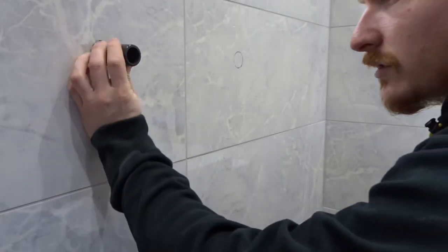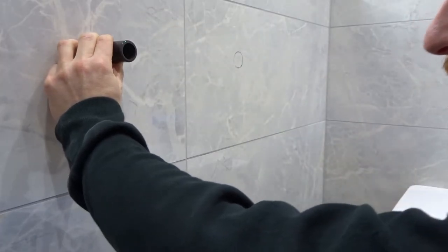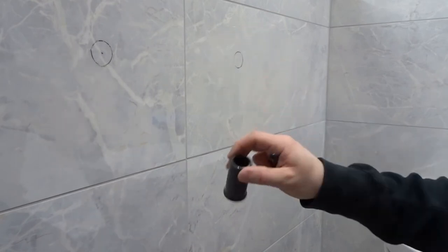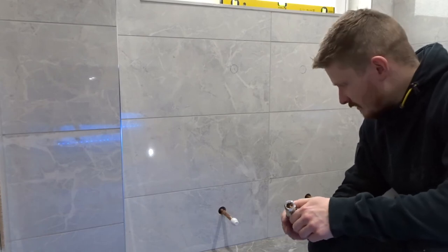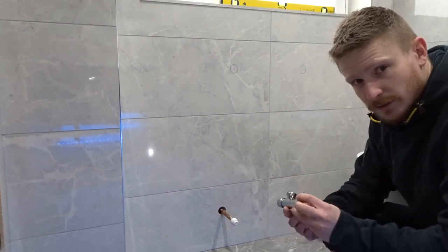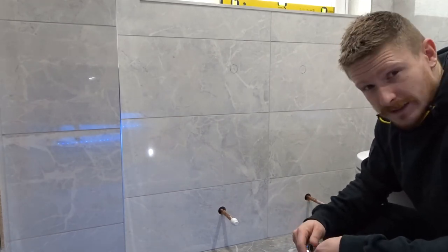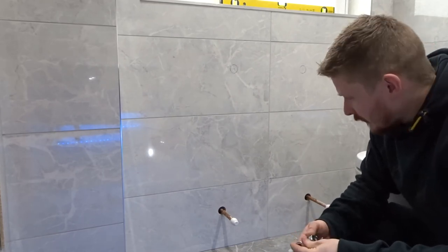You can see the circles that we drew — we need to screw this bracket piece to the wall. Line your bracket up in the circles you just made and put a little mark in the middle where the hole is. These do have a bit of a slot so small adjustments up, down, left and right are possible, but not a huge amount, so we need to get it pretty accurate. Before we go any further, I need to attach these valves to the copper tails coming out of the wall. I'm working on a live heating system with a bung in a gravity-fed tank, which means I need to create an airlock — so I'll put these valves on one at a time. If you're working on a dead or drained-down system, you can open both pipes and slide the whole thing on.